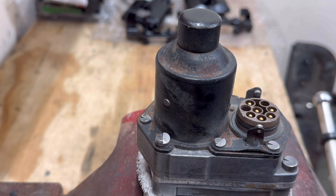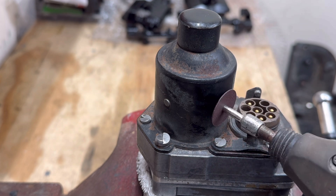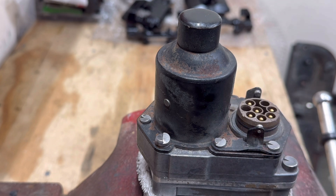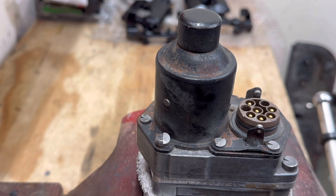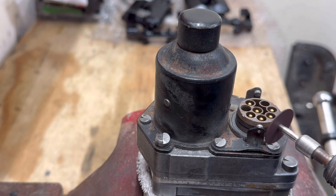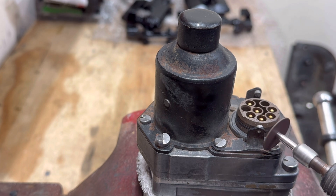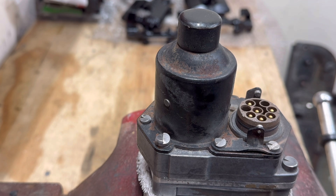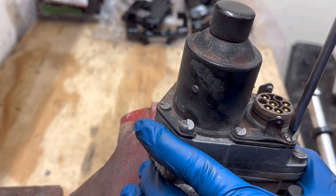I've got you set up so you can watch how I'm going to cut a slot into these screws. You want to pick your angle because there are some spots where you just can't get in. Like this one is going to be a little tough, so we'll have to find a spot where we can actually get the Dremel in there. If I cut here I'd have to cut pretty far through, but if I come at a different angle, now I've got something to bite in — I just have to be careful not to take the housing out. I've got the vise on my workbench so I can move it around and get the right angles. You don't need to go all the way through, just far enough to get the screwdriver in with some bite. There we go — we're starting to back her up.